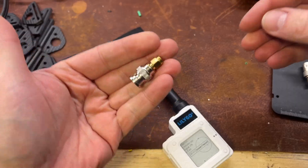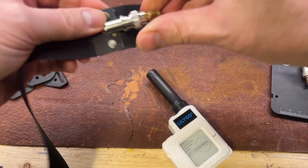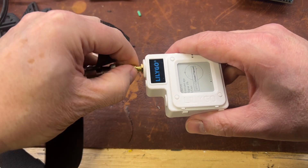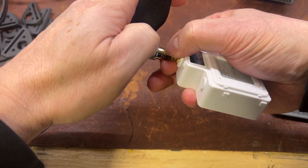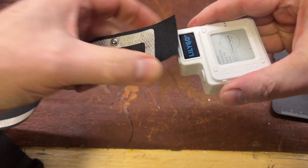The last thing you're going to need is a BNC to SMA connector. Generally the Meshtastic nodes have an SMA adapter on them, and that is how you're going to attach it to the system I currently have. I will start looking into doing an SMA adapter board, but we'll have to wait until the future for that.